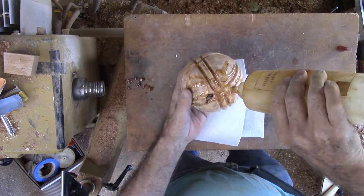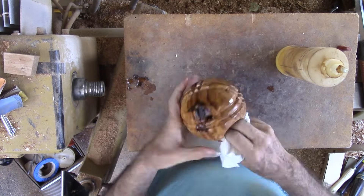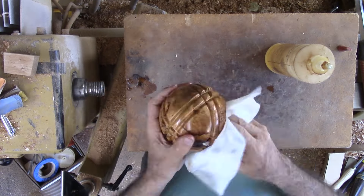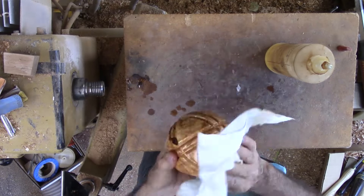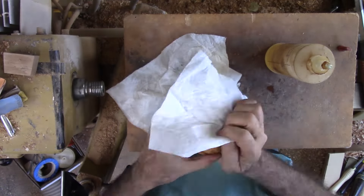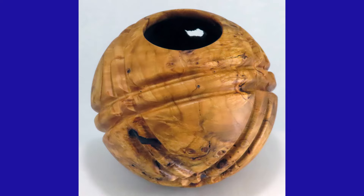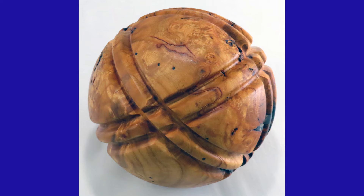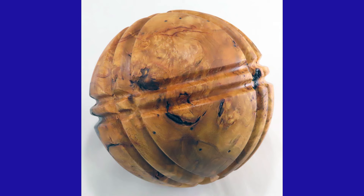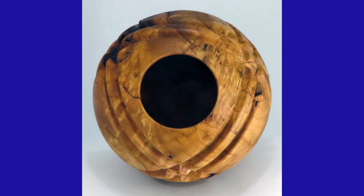After some touch-up sanding with the sanding pad, a bath with walnut oil is perfect for this project. It brightens the wood and brings out the grain. Another bark inclusion left the scene for a second window into the interior; the UV resin is a somewhat translucent window. The lines from hollowing give it good texture and lighter weight. I could make a lid for it, but I think I will leave this one alone — that would be gilding the lily. Please give this video a thumbs up and subscribe to my website as well as on YouTube. When you subscribe to my website, my notifications are much more reliable than YouTube's. Please tell your friends about my weekly videos. I do appreciate your comments and questions, but please wear your full face shield whenever the lathe is running.